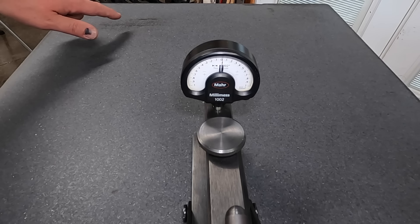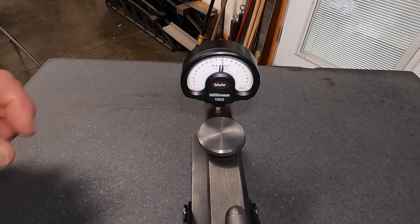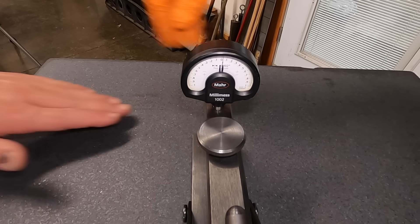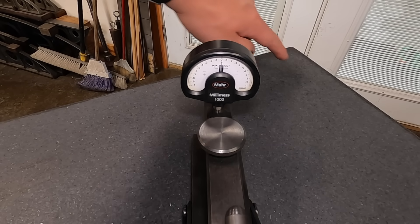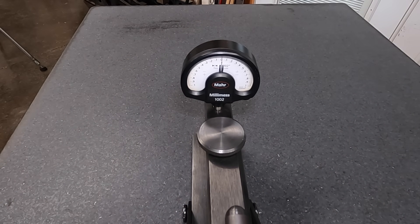Right there is a low spot but you really can't see much of a difference — it's probably the diameter of the little carbide pad bridging that little dark spot right in there. There appear to be some linear marks, almost like rub marks through there, and it's probably bridging those little variations. There's a little spot right there and then across the edge as well. So we're going to let this set overnight, let it dry out completely in this AC room, and then we'll check the overall elevation differences in the morning. Since this worked so quickly, we can get more aggressive with the time we have — maybe get you a double-A by the time we're done.